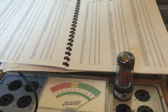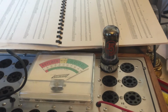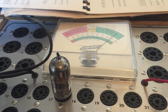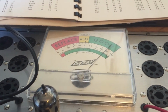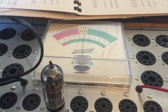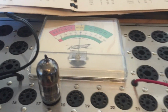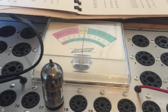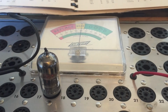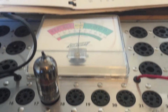This one's off the charts. We'll just move them on. The other 6V6 will live to see another amp. This 12AX7 shows a little bit weak emission, but it's a Sovtek, so nobody really cares, first of all. Second of all, if you were looking for a slightly subdued input without swapping out tubes, that may actually be a good choice. We'll save that. We can always swap out. It's just a 12AX7, nothing special, but worth noting.